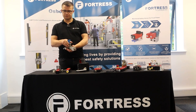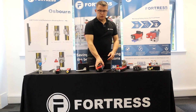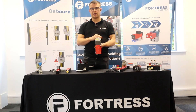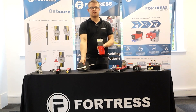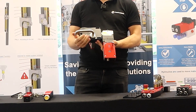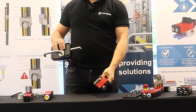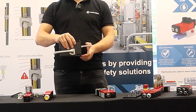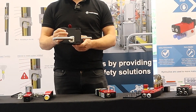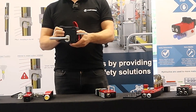We have stainless steel options available and will link to those separately. Coming back to our heavy-duty guard locks, we have the ability to offer them with ergonomic handles, making them incredibly useful for anyone looking to have an integrated door handle — so if they just pull on that silver handle, they can open the door. Similarly, all tongues provide a large amount of misalignment to cater for mounting variation, door sag over time, or any movement in guard construction, with left, right, up, and down adjustment.